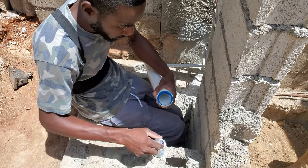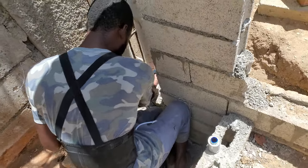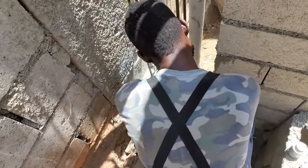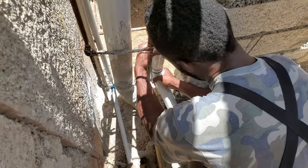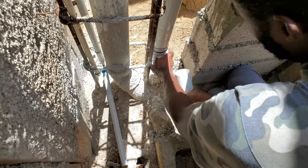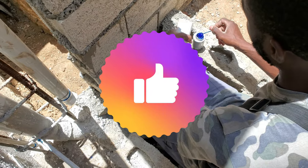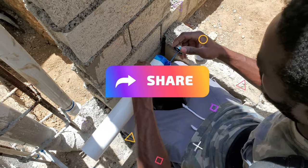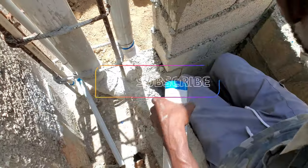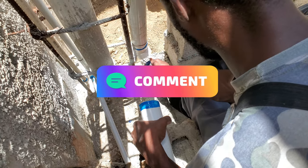This bad boy. I can see everything from this angle. Some people use primer on the pipe, even when the pipe is clean. I just wipe off my pipe exactly where I want to use it. And now no time for primer. I'm cheap, you know. Priming is supposed to melt the plastic, and then when you glue it on or put it on, it's supposed to weld tight.